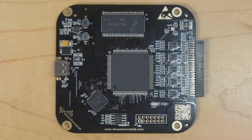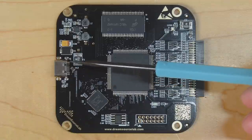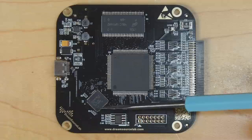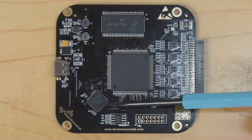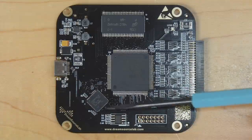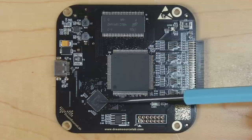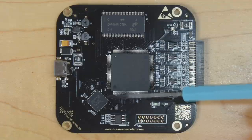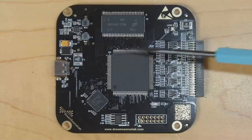The logic analyzer is a relatively simple thing — it samples the data coming in on the input port pins and packs them into USB packets that get sent to the PC through the USB port. In the middle of the board is a Cypress FX2, which is a bus adapter that takes data on its parallel pins and packs it into USB packets, and can also do the reverse. The FX2 has a built-in 8051 core which supervises communications between the board and the PC and controls the functions of the rest of the board.